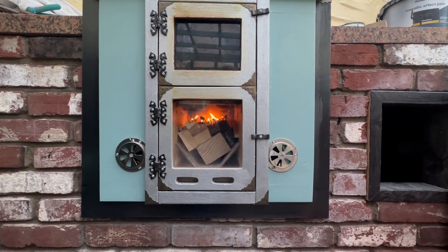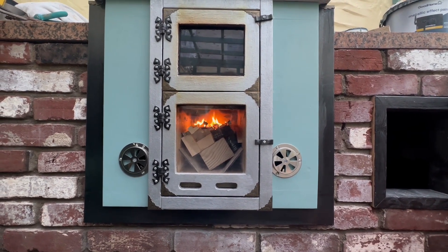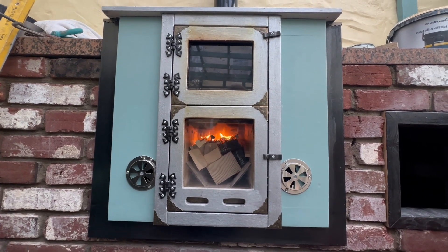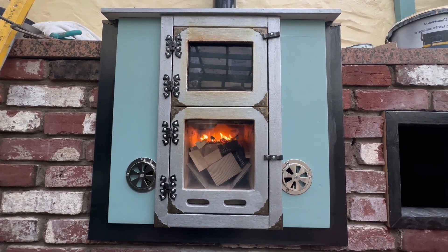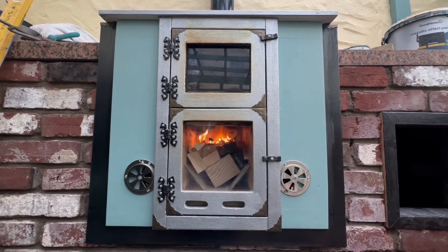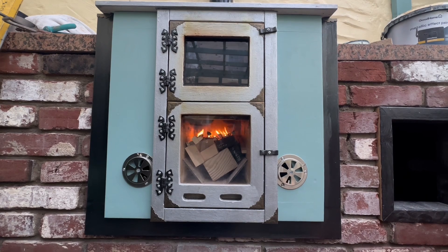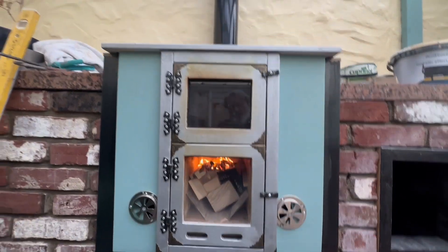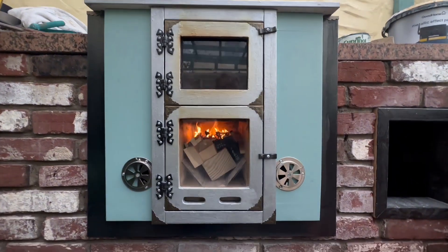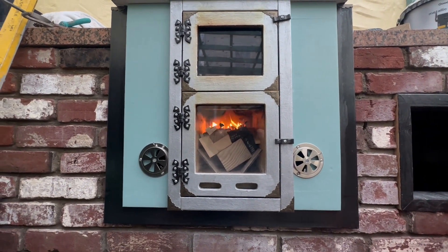By lowering that gap it's caused more resistance, but unfortunately it's stopped the fire from starting up as easily as it normally does. Since day one with the vortex I've never had any issues with startup, but this isn't catching well — it's been about five minutes, the firelighters have died down, the wood is struggling to catch, and the top glass has gone black. It's amazing how much difference small changes can make.